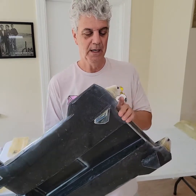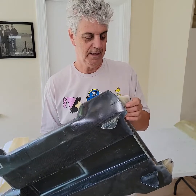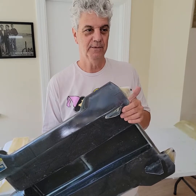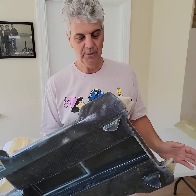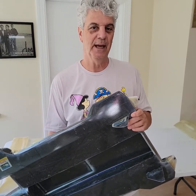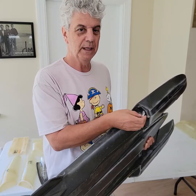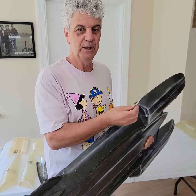Since we're talking about the back of the boat, the rear shoes — this is an extension that's on here. Different years they did different things back there. I have photographs on my website, and you can email me depending on what boat you're building and I can send you pictures showing what they did. I can build it without these on there, and you can add other extensions that were square and so forth — just email me with any questions. Also on all my hull kits, I use quarter-inch aluminum for the turn fin bracket, which is epoxied in place inside the hull. So when you're mounting your turn fin bracket, you drill and tap into a piece of aluminum that's going to be really strong.